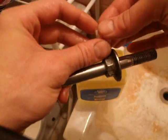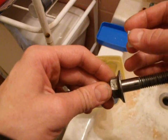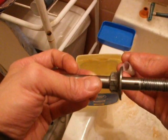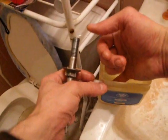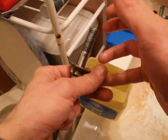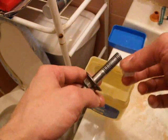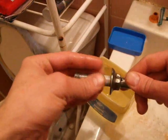Step number one. I'm gonna put a ring onto the stick to protect the epoxy and the whole coil from sticking to the metal case of the winding machine. I'm gonna use this paper tube with scotch tape over it. I'm gonna put petroleum jelly, or simply Vaseline, inside here, to lubricate it from inside so I will be able to take the coil with this inside ring back from the machine. I'm putting a lot of petroleum jelly to make sure the paper absorbs it and it will not go out. Then I'm putting this protection ring onto the bare metal of the stick.